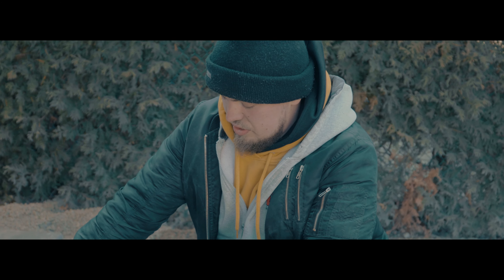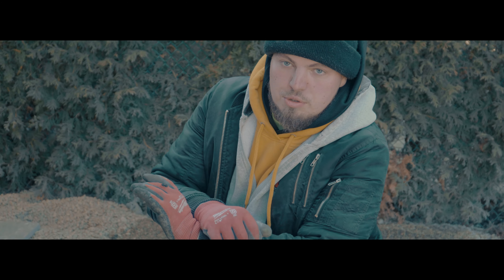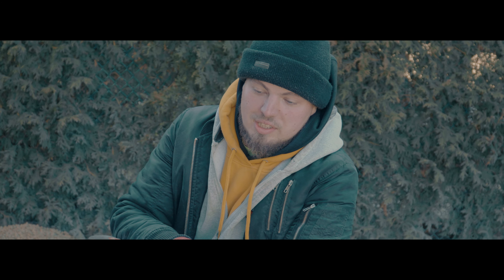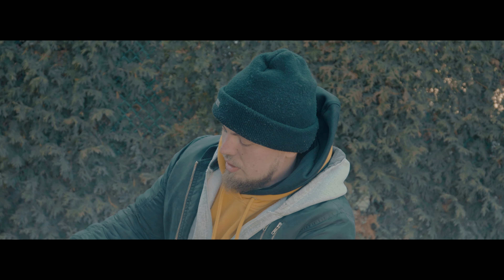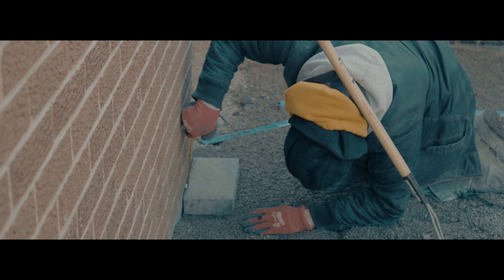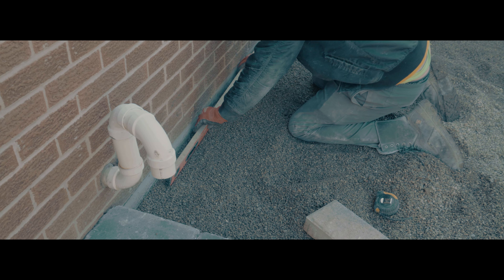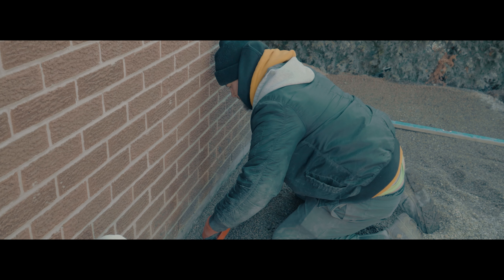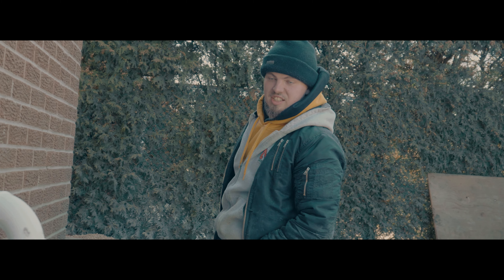So what I'm doing now — I'm checking the height of our stone under the brick line. The customer requested that the stone be one inch below the brick. I just want to check that the brick line is all one level because our stone has to be one level. So if the brick's a little lower here or there, I'm going to check our lowest point. Between here we have perfect level — the brick layers did a good job.